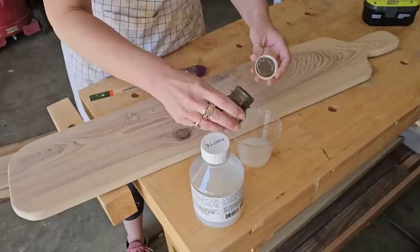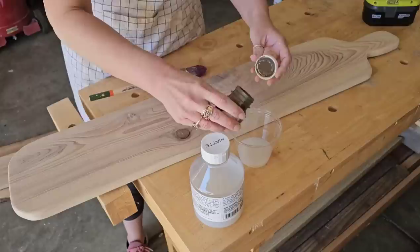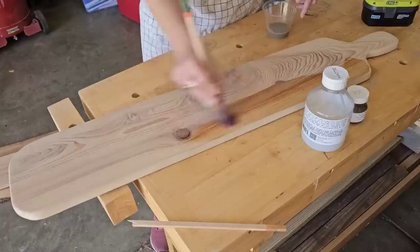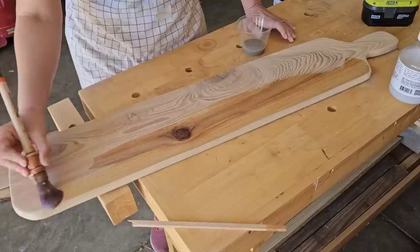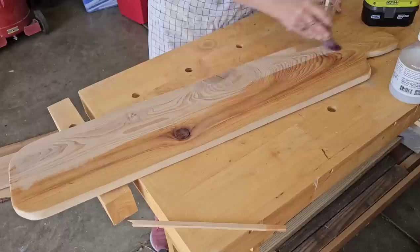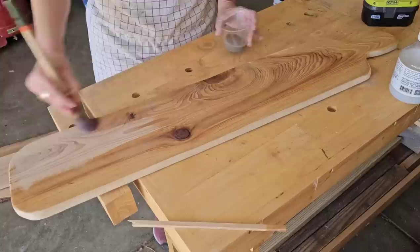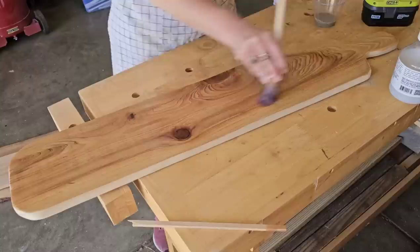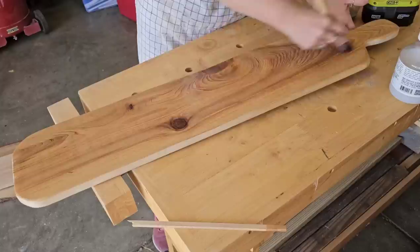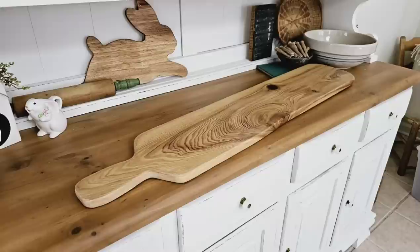I am not worried about this breadboard being food safe — this is going to be a piece of decor only, so I'm going to be using Fusion's Matte Tough Coat. And I want to bring a little bit of richness to this board, so I'm going to be taking Fusion's Antiqua Glaze and just adding a little bit of that into my sealer. This will ensure that no yellow tones come out. I want to make sure everything is a very natural wood brown color, so I'm going to apply just two light coats on here. We're going to be writing on this board with Sharpie, so definitely if you're going to be coming back and writing on something, you want to seal it so that the marker or paint pen doesn't bleed on the wood. But even if you're not adding something to it, I would definitely suggest sealing it — look at that beautiful wood grain. And if you wanted it to be food safe, you could use Fusion's Beeswax or hemp oil. I have all of these products on my website and I'll have a link to everything in the description below.